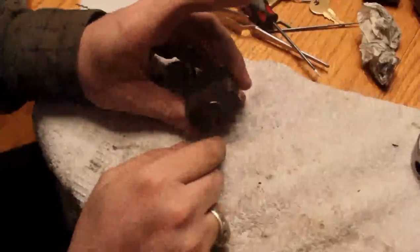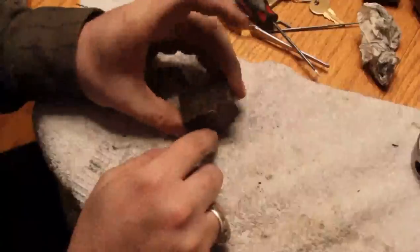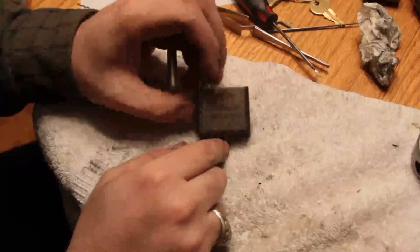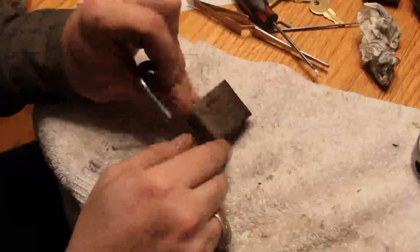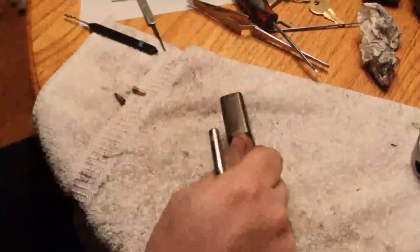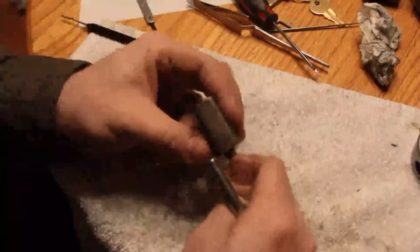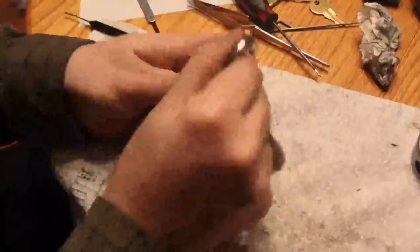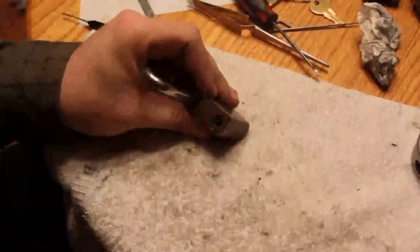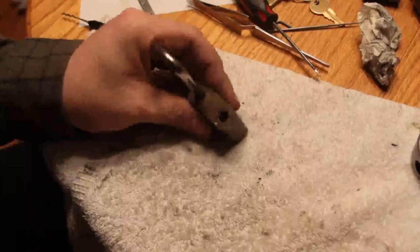To get this out on these locks — which have all been used a bit — I took the screws out and the instructions basically said to take it with a rubber mallet and whack it a number of times to basically drive the pin down. That didn't work. So I got out my trusty can of WD-40, sprayed a bunch in there, let it sit for a few minutes, and then repeated the procedure with the mallet, and sure enough they all popped open.